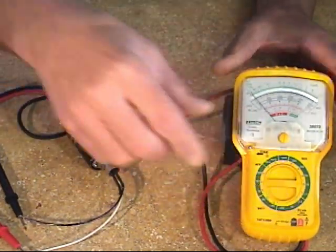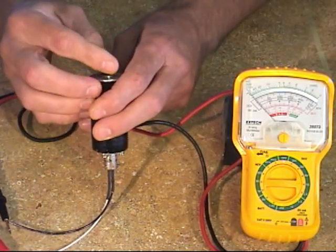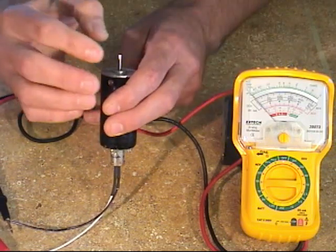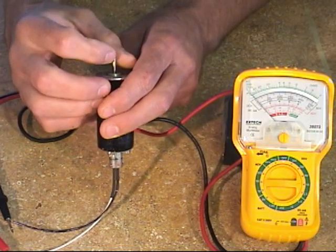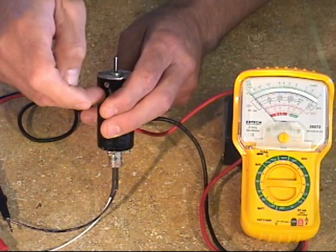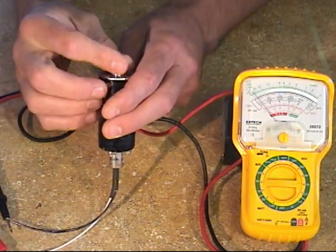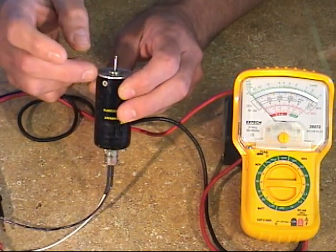Next, we'll leave the analog meter on and turn it to volts. With the tachometer face towards you, turn the shaft clockwise — the meter should read positive voltage, assuming we've got our polarity right. What you're watching for is the tachometer being internally wired backwards, which might drive the needle back in the wrong direction. That would indicate a transducer wired incorrectly internally.